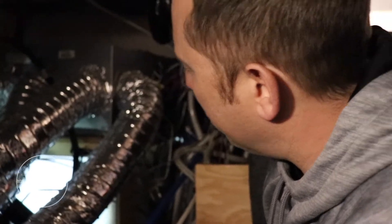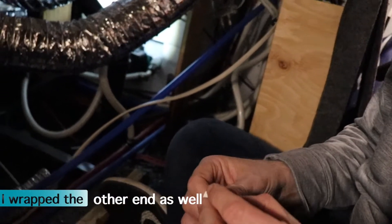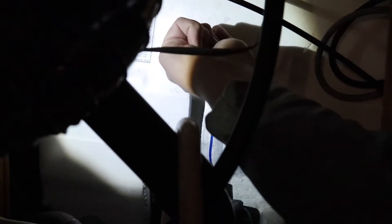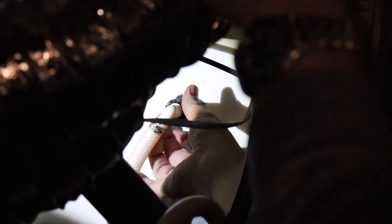I've got the arrow confirmed, so I'm going to put a little Teflon tape on the piece that's going into the hot water heater, do a couple of wraps and tear it off. Now get it hand-tightened while I can. I don't have a wrench big enough for this so I'm going to use my pliers and give it a few good turns to make sure it's nice and snug. Now I'll grab my outlet hose, hand tighten that back on, and give it a couple turns with the pliers as well. That's nice and snug. Now I'll go turn my water back on, turn on the hot water heater, and we'll see if we're good to go.